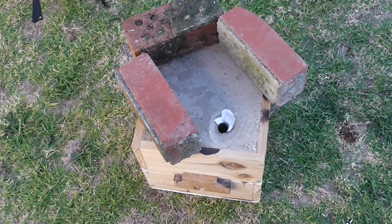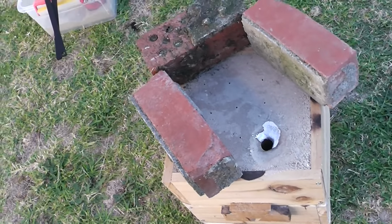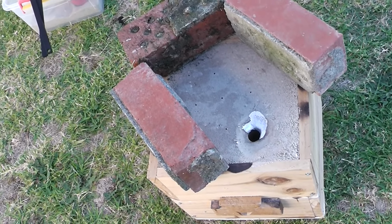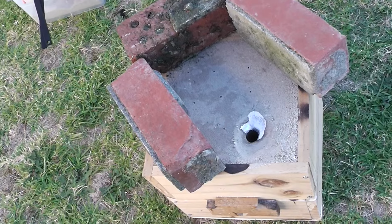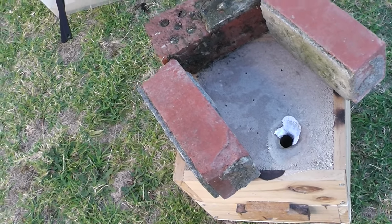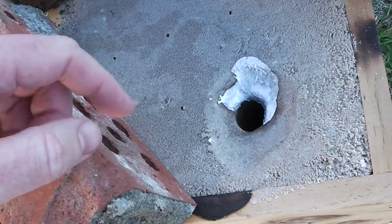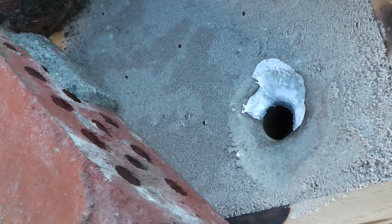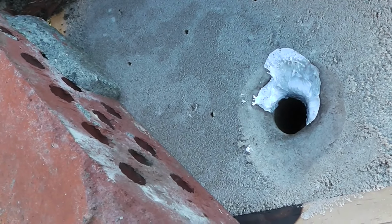Right, third attempt at pouring this thing. Two changes I made. One, bricks on top. The bricks are to stop any blowout, by pressing extra weight down on the cope to stop it from lifting and the metal getting out. The other change I made, instead of a gate and a riser, it's just one gate going right down, right next to the pattern itself. It's to minimise the amount of metal it will need.